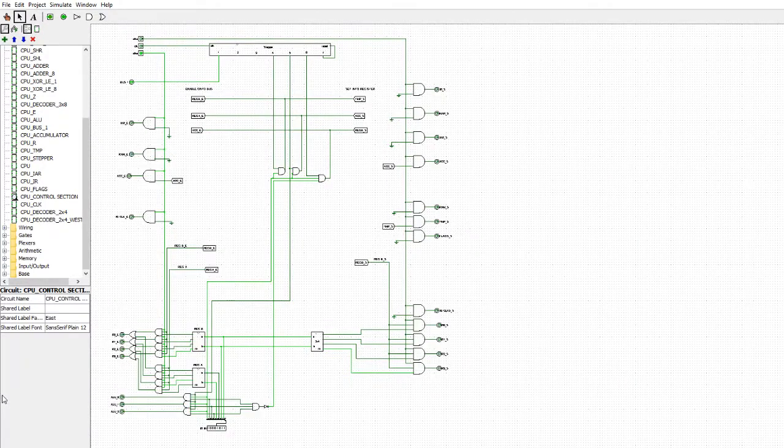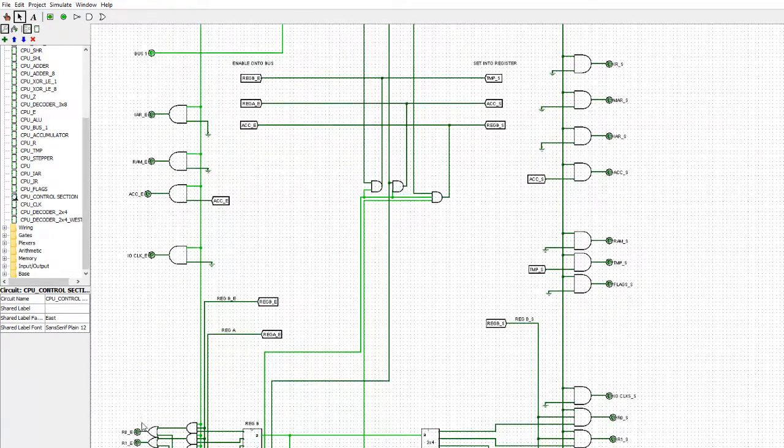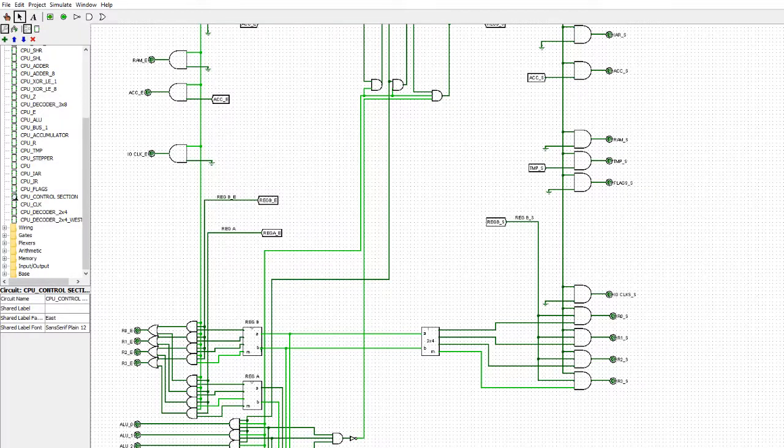Okay, so excuse me. This here is the input. So that's the code that we've just created, the instruction that we've just created, which is the 1000111. Now I'll make it a little bit bigger, so that it just pops off the bottom of the screen, but I don't think you're missing very much there. So you have the 3 AND gates there, and just below there is the instruction register input. Okay, so let's start off, and we'll break this down into little parts.